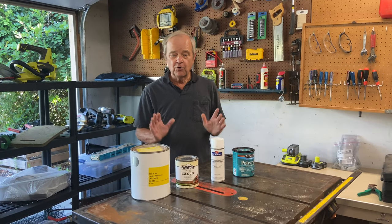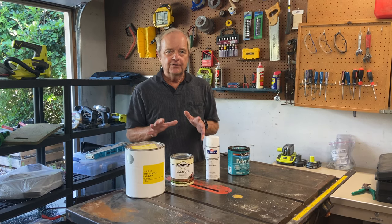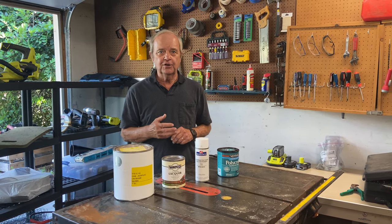We brushed the polycrylic on and were very careful to keep a wet edge. It dries quickly, but not lightning fast. On a table this size, you could not use brush-on lacquer — you would have to spray it, because the immense size makes it impossible to keep a wet edge across the entire thing. So the polycrylic worked out very well. Lacquer would also work well on this project, but you have the downside of the smell and toxic fumes. In summary, lacquer is durable but must be sprayed on for large projects; it can be brushed only on small projects.